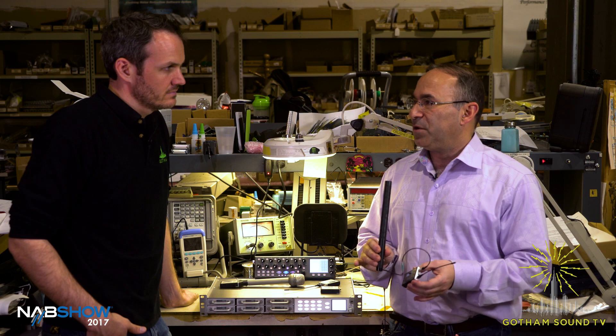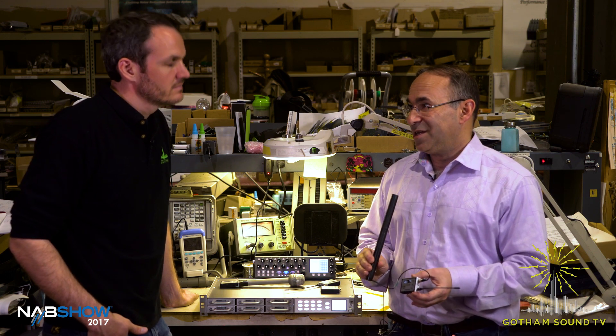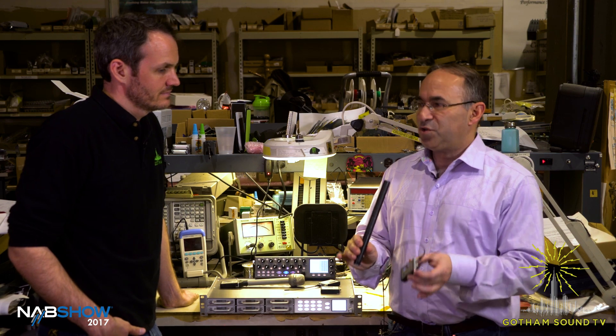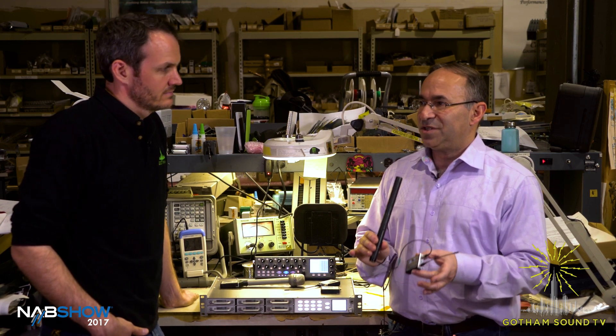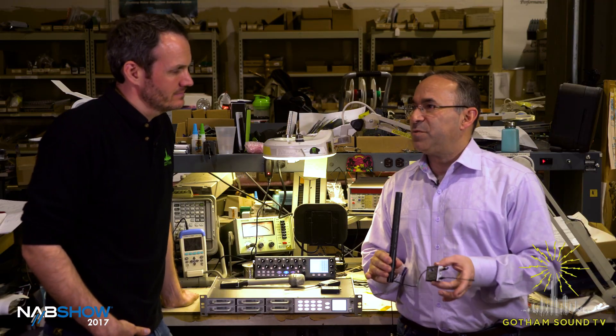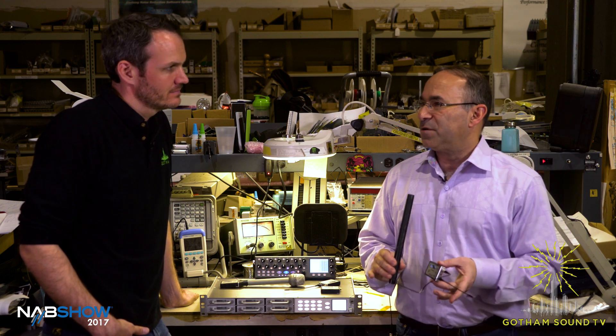The phantom power supply is in here — it is 12-volt and 48-volt capable, and it does some other voltages as well. It is a true balanced input, so occasionally people will have problems with lighting buzz and other induced noises, but this should be totally free of those because it is designed specifically to run a microphone on the end of a boom pole. This will really change the way people use and operate their boom poles because you're actually going to save weight on the pole. When you pull that cable out, you're pulling out something that probably weighs two to three times what the transmitter weighs, so you're actually lightening up the pole and removing the cable that can make noise in the pole. This is a really big product for us — we think it's going to be a transitional product for people using the boom pole.